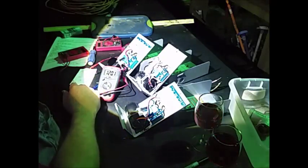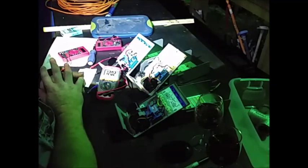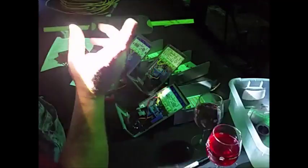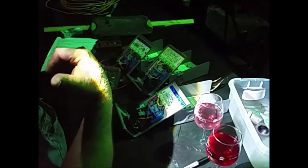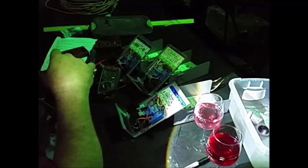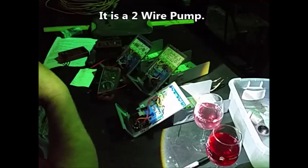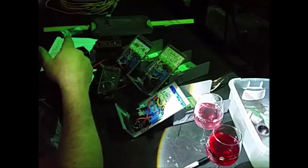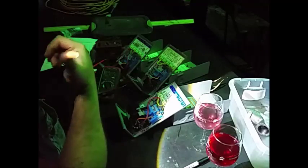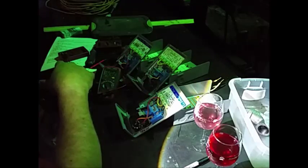I've got a bunch of pumps I have to maintain. I recently moved to a two-wire pump with a capacitor built into the pump itself. I've got four wells that I maintain. The only well on this property — after 10 years — that I hadn't worked on is that one down there. It usually should have backflow valves on it, and that's the only one that doesn't. But it's backfeeding down to the pump. That pump cycles about every 15 minutes even when the water's not being used.